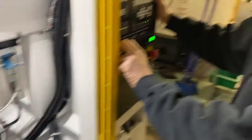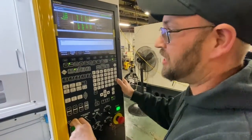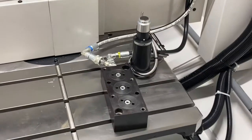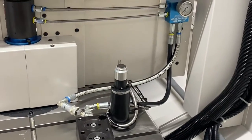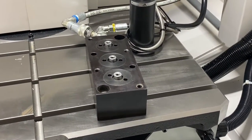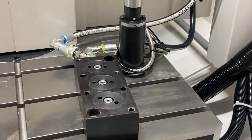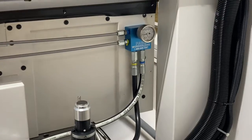We are going to test the hydraulics now. You're going to M-code activate the system — clamp and unclamp on pallet one. I'm going to zoom in on the test fixture. I just unclamped it. So that is working. We've got some cylinders and pistons here. I clamped it again. The gauge shows we're running right now at a thousand pounds.